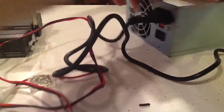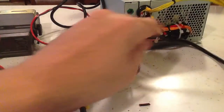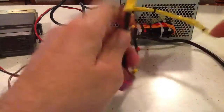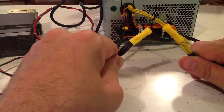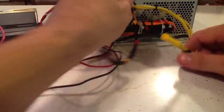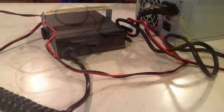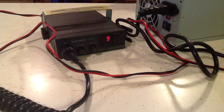Out the other end of a computer power supply, your yellow wire gives you 12 volts, orange or red gives you 5 volts and 3 volts. I'm not using 5 or 3 volts — just 12 volt. I'm pushing out 20 amps with it, which is quite a bit. Some of the $75 power supplies I was looking at were only pushing out 15 amps, so we're actually getting more than a high-dollar power supply. We got it all hooked up — moment of truth — and we do have power.